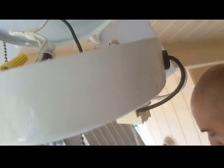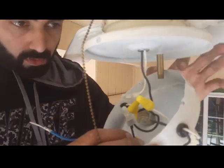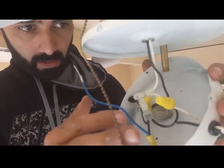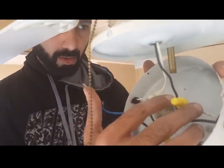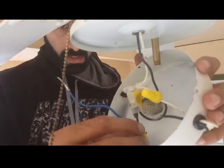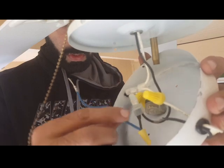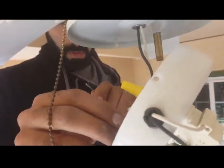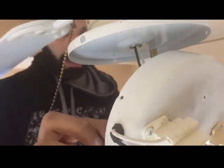With the ballast removed, I went ahead and stripped the ends off the black wires and the white wires. I went ahead and combined the two white wires with a wire nut. When I went to combine the black wire I found it was a bit short, so I added a little blue jumper wire. All we have to do is connect these up and add the wire nut.